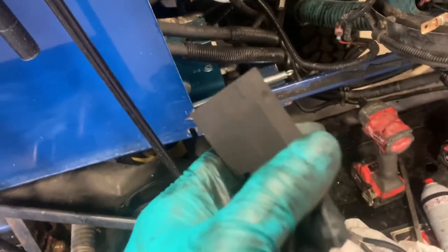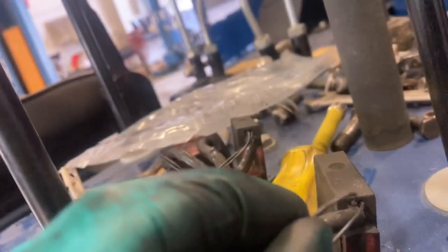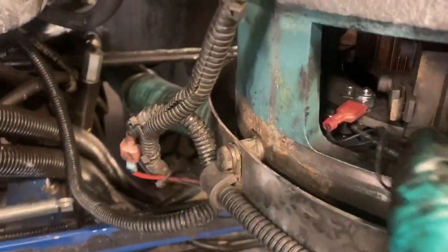I imagine those wires go into the brush to a certain depth and will come on before you wear them out completely. I've got it apart so I'm just going to put new ones in. That was one of the problems. The other one I found is that when I took it out, this one was broke — it just broke right off. It could have been broke for a while. So that could have been from either one of those. When you put the brushes back in, just make sure you don't forget to hook those sensor wires up.